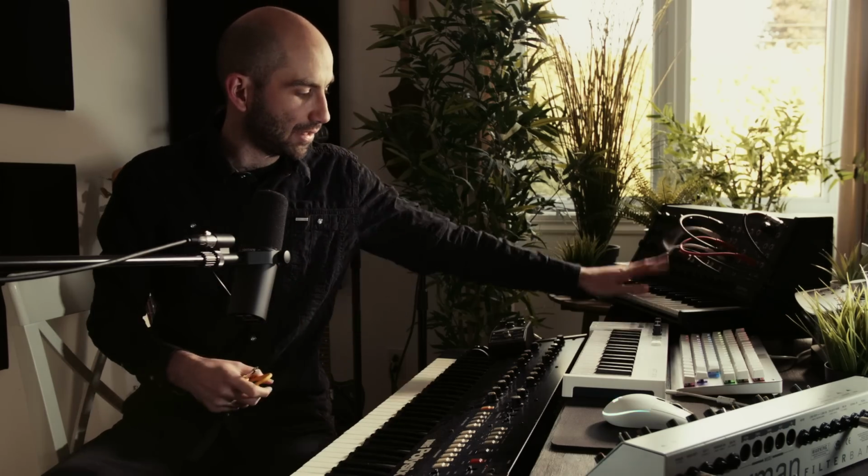The secondary benefit of patch bays for my particular case is that I have a 2-channel interface, and the patch bay allows me to easily pick which 2 things I want to route into those 2 channels. For example, I can easily route the MS-20 and the Poly 6 into those 2 channels, or I can switch it to have one of my mics go in and the Poly 6, or I can have 2 mics, or I can plug in a guitar and a bass really quickly just by patching a simple little cable like this in the front.